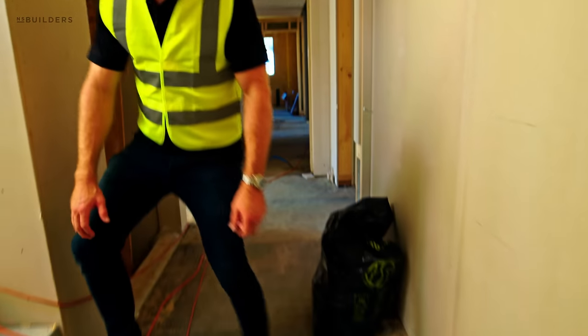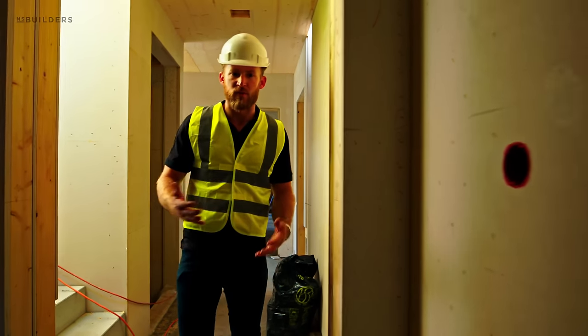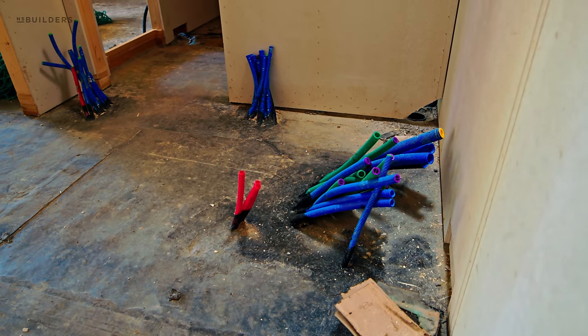So looking at this right here, this small step, to me that says this floor is going to be built up to this elevation. Again, a pretty typical detail we're seeing everywhere, where they're putting in a soundproofing layer, and then ultimately putting a concrete slab in preparation for the final condition.